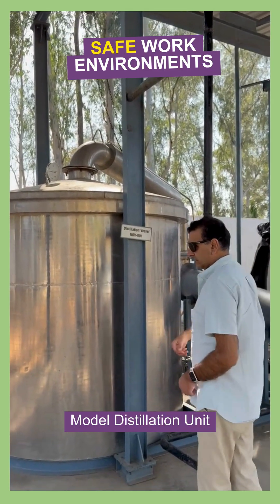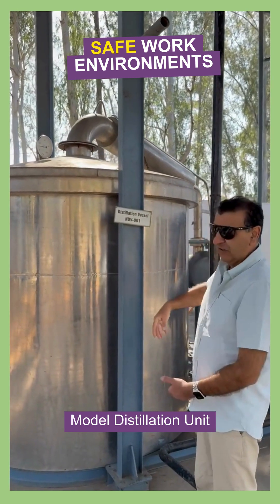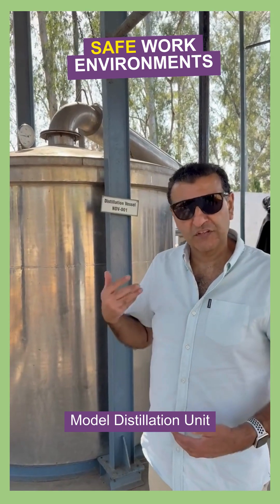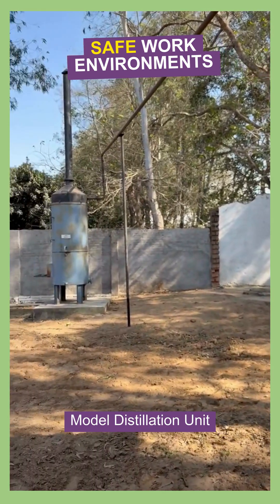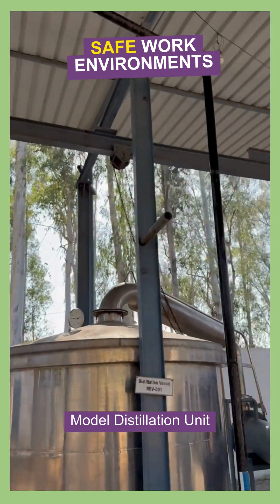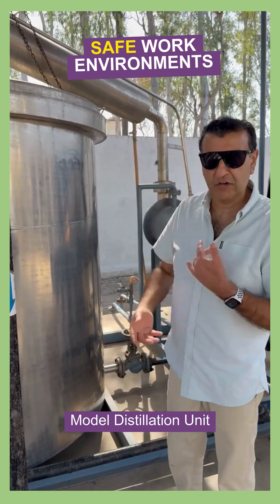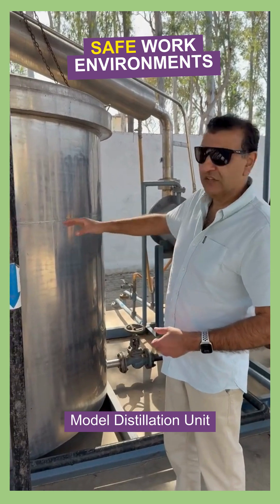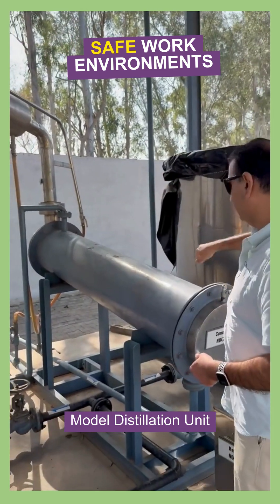They bring the plants in with the biomass, loading one tonne of biomass into the distillation vessel. The next step is to generate steam using a boiler, which sends steam through a pipe underneath the biomass. The biomass has been slightly wetted to generate even more steam, and then the essential oil flows up to the top through a series of condensers.